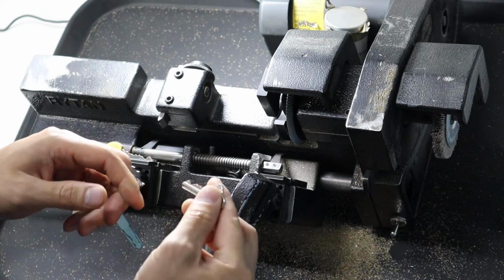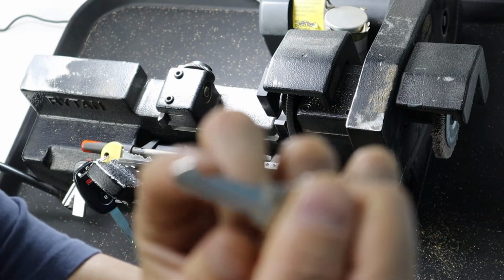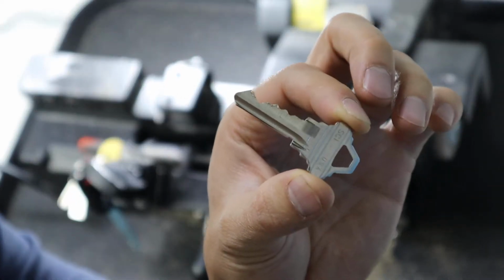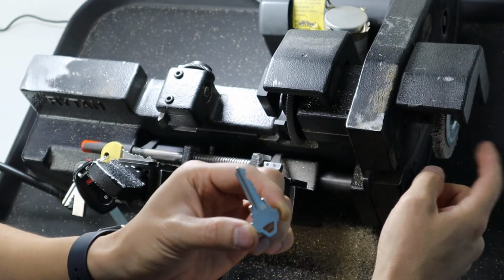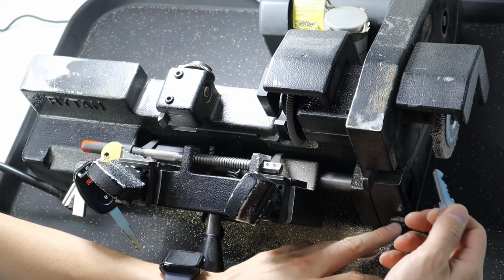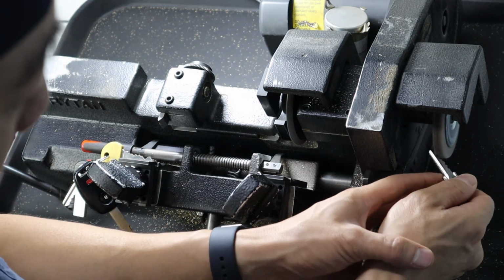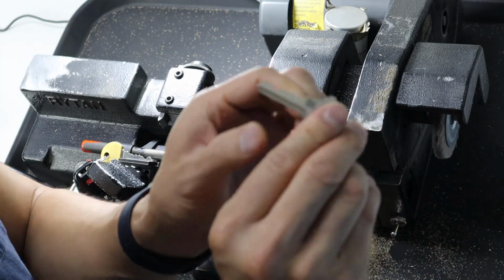You want to check. Well, first off, let's deburr. So you'll notice that the key, probably won't get in focus, but the key, when it's freshly cut, will have all these metal shavings on it. And so we want to clean those metal shavings off of it. You do that through this deburring, rotating, I forget what it's called, but this allows it to deburr these little shavings. You just turn it on, follow the grooves. I like using the corners. Once you do that, you have deburred the key.